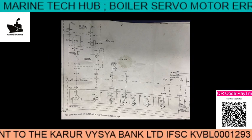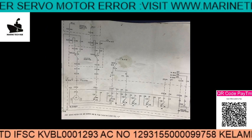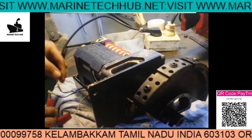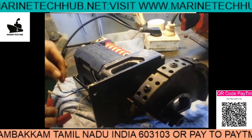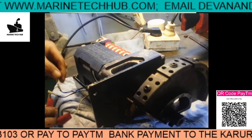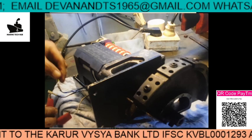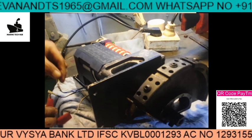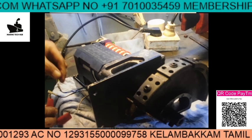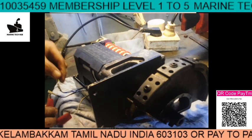I appreciate you. At the present moment our boiler is working. The problem was that our servo motor was stuck. Before we started, the servo motor was completely overhauled in the workshop. We observed that inside, the gear had old grease stuck in it — that was probably why it could not rotate well. After we put the servo motor back, we observed it started moving in both directions, up and down. However, we could not move it by hand because of the many gears inside.